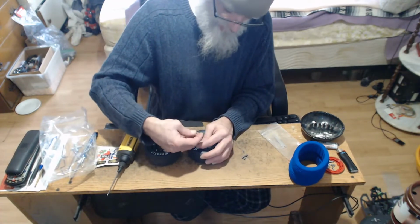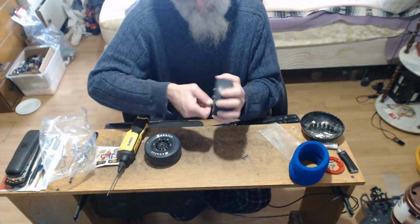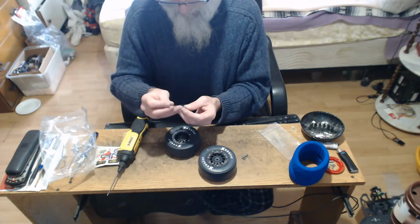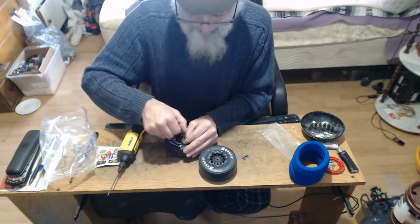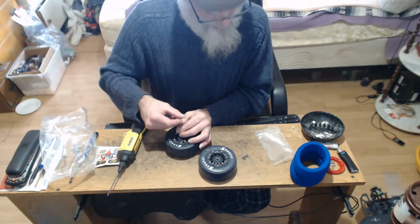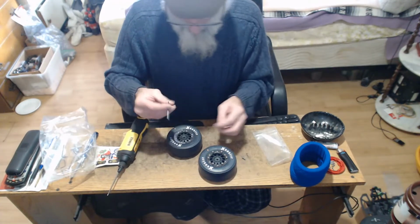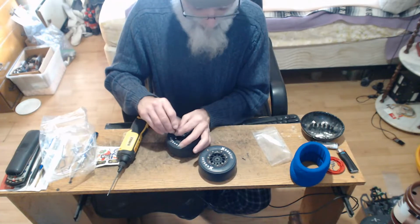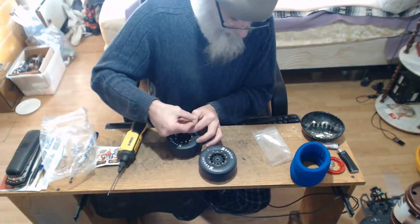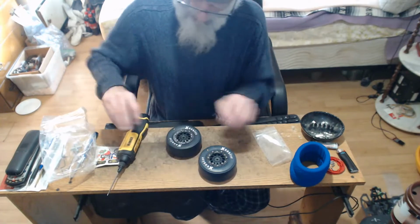So the biggest thing about starting them is getting them square and in the hole. Sometimes it's hard to tell what you're doing if you're not doing it by hand. If you use a driver on it, even just a hand driver, and not using the finger thing, sometimes it's a little trickier, but when you've got the electric drivers, most absolutely. Got to make sure you don't cross thread. If you've already got threaded holes started, that's even more reason, especially in plastics. Plastic can be very easy to strip out with these, metal, aluminum, steel screws, stainless steel, whichever, titanium. That plastic doesn't have a chance. So it's always wise to start with a hand wrench, and then transfer.